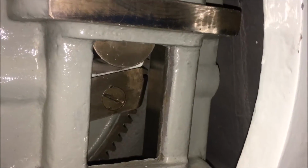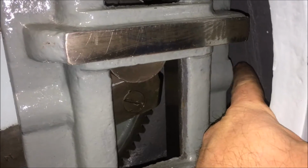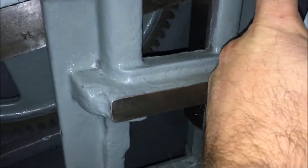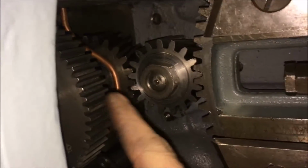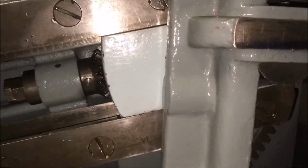So we're just weighing up space for an oil cup. This is at the extreme stroke. That's the spot I was looking at putting the oil cup in, and it's tight. Unless I bring it forward, which might be an idea, in which case I can stick it here, because this face goes right up next to that gear there. There's very little clearance. I've not got the slider block in yet, but it's not enough to make any difference.